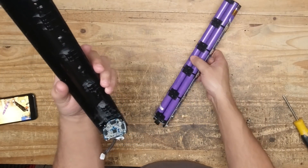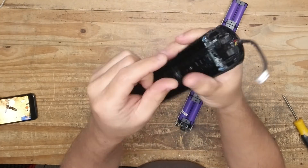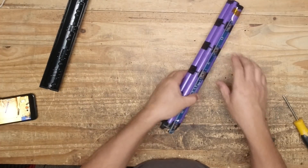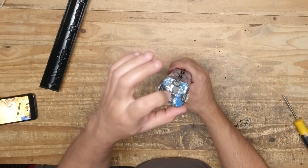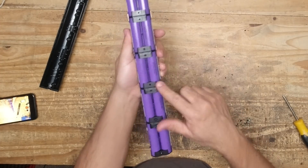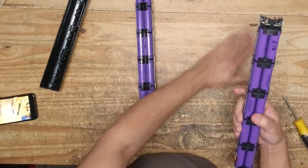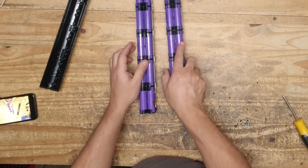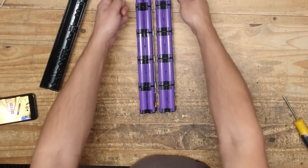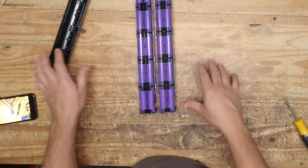The top part of the BMS stays in there attached to the top. Since we can't use that because the cables are cut off, that's okay. Here is the bottom side of the BMS — we'll have to cut that too. Now that you have that, you'll expose the back side, and it's got screw holes, which is pretty cool. In theory you could screw these onto another board, put a bunch of them together, and have access to each battery terminal to install an external BMS — but that's for another video.